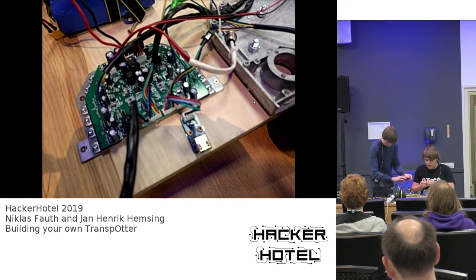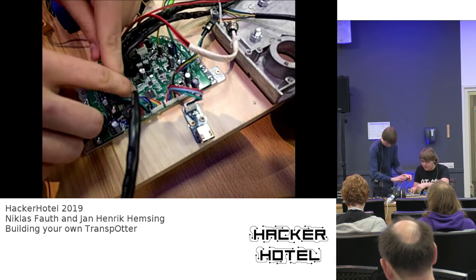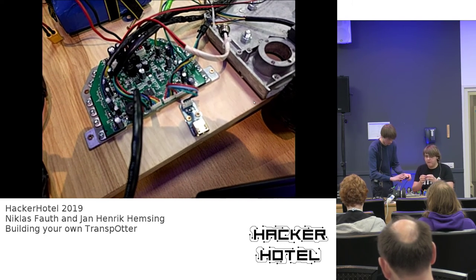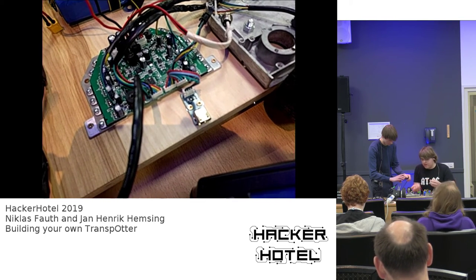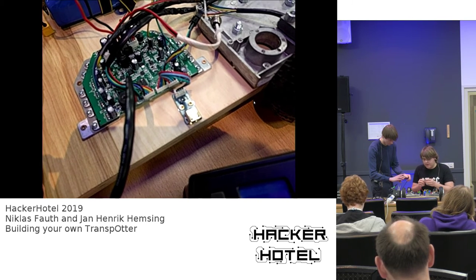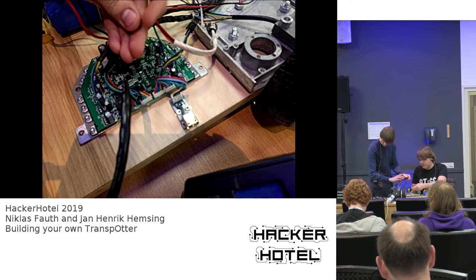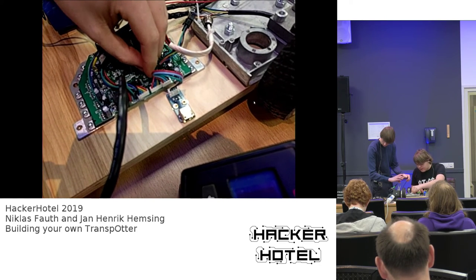Okay, so as we mentioned earlier, the connector is not soldered in because in the factory the board is programmed just by holding it to the pads. So the first thing we need to do to reliably be able to program the mainboard is solder on a standard pin header where we can attach jumper wires. And because we can't access the back of the PCB, that's a bit tricky. So the way we usually do this is to use the pin header, not the way it is intended to be soldered in, but we first solder it in upside down like this.